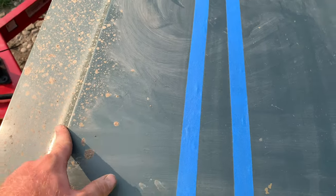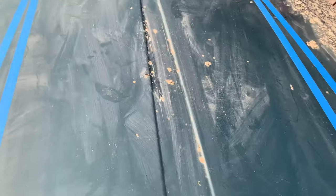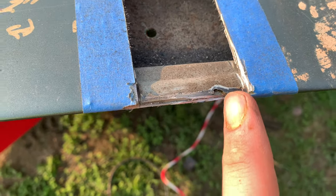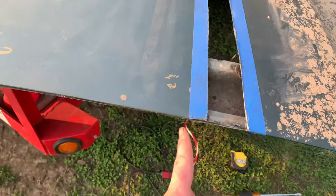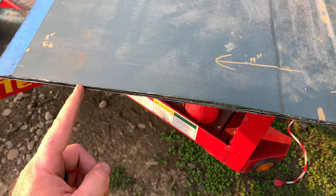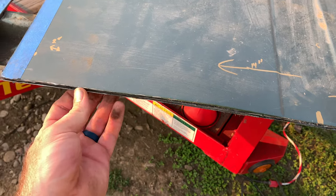Run another piece of tape and come out here — I made this exactly two inches apart on both sides and did some measuring all the way down through here to make sure it's all the same on both sides, so it's all even when I go to cut it. Take a grinder and go across here — this is what it looks like when you cut both sides.